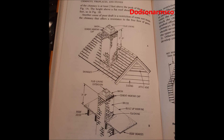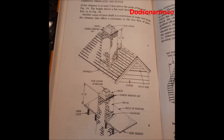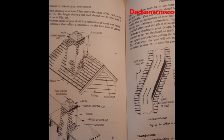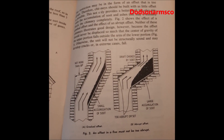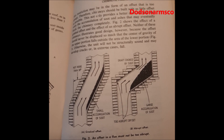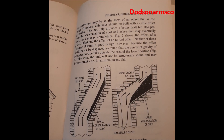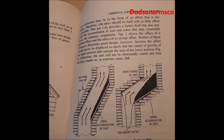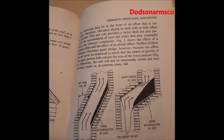Volume 3 is an excellent reference for building chimneys from brick and flue lining material. It gives you quite a few tips on how to angle them if you need to angle them. Personally, I prefer not to do that. If you angle it too shallow, you actually get a large accumulation of soot and creosote, which can cause chimney fires.